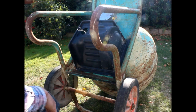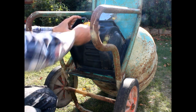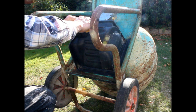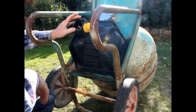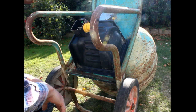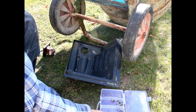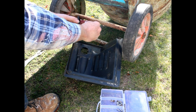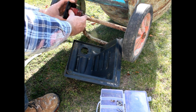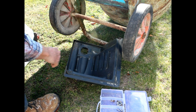The brown wire is on the other side with the thick one at the back — that's how the capacitor was set up. The switch has to be mounted to the plastic cover from the inside with four screws, with the plug to the right. The wires are fed through and connected to the switch, which is then installed back in the box. I kept everything in a box so I wouldn't lose anything. I used Q-tips to clean all the electrical connections — sprayed with contact cleaner, used a Q-tip, and put them all back.